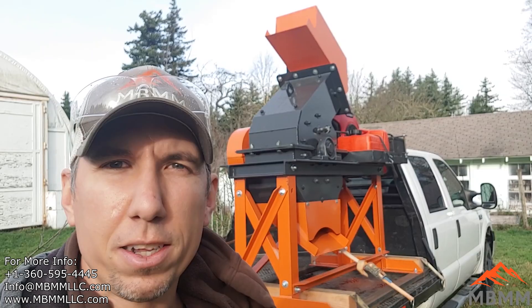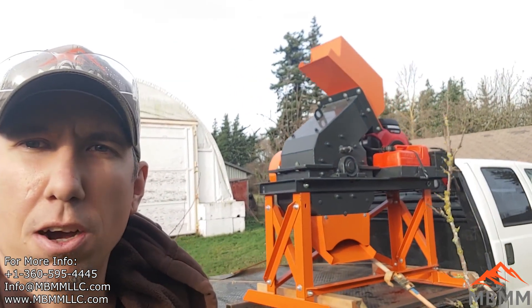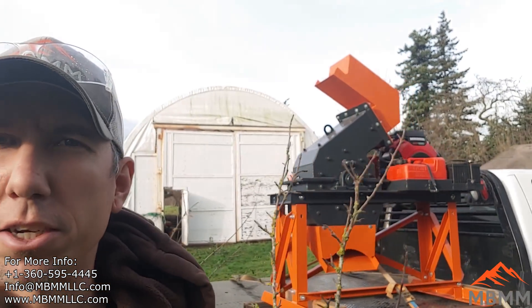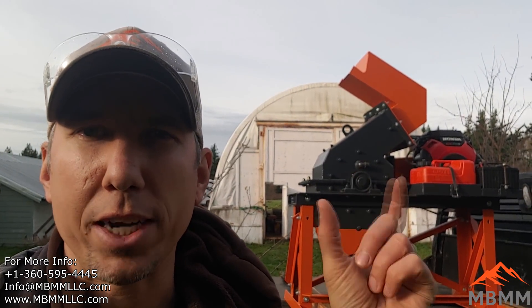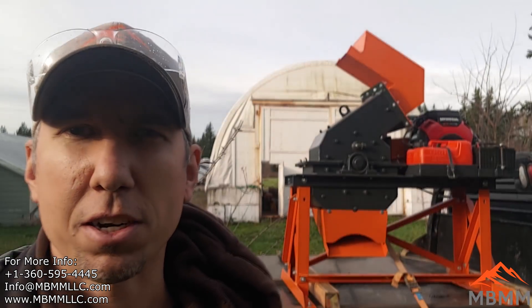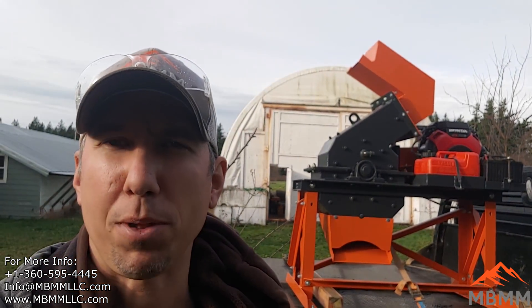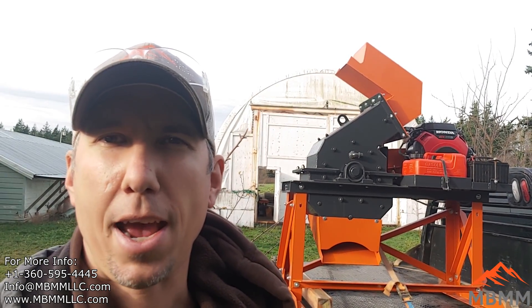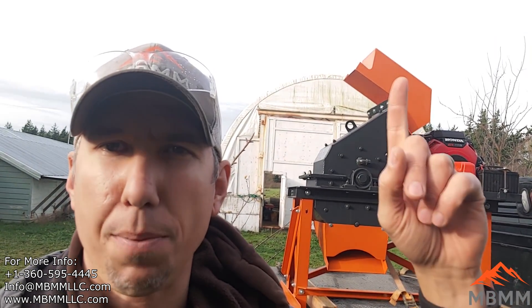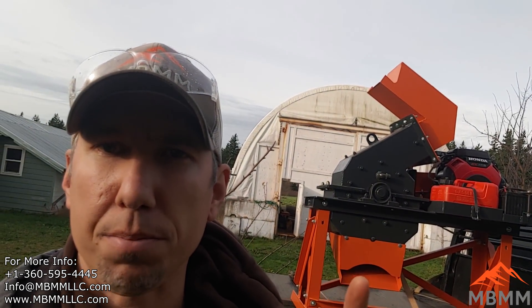So a quick little rundown of the mill here. This is a 16 by 12 gas powered hammer mill. You can see the Honda gas engine over there behind it. It's got a quarter inch screen in there — a quarter inch slot, about three inches long. And we're going to be running with hammers today. I thought about putting some shredder blades in there, but we got hammers instead. I'm going to just dump the apples down the top of the orange chute up here and it's going to beat all those apples up and come out the bottom of that chute right there.